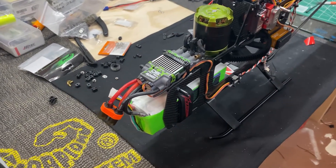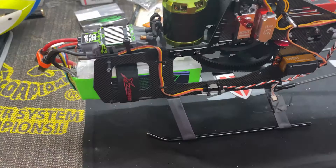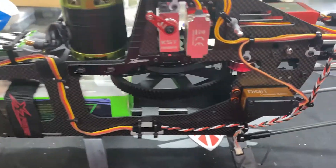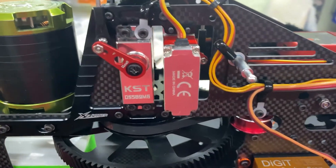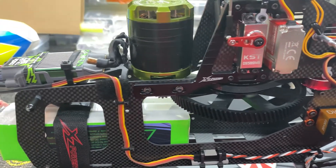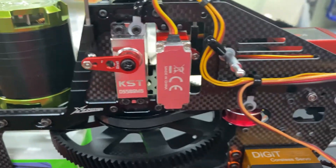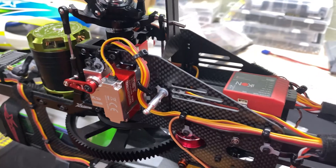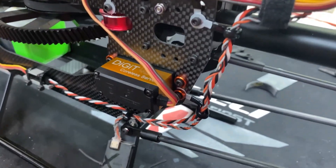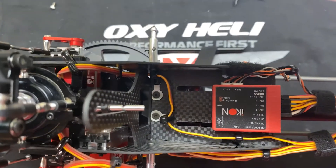Here's a quick look at the wiring - got the motor disconnected for setup. That's a six-cell Pulse 5000. All my servos - opted for some KSTs I had, and instead of using the included control horns, I bought these Seat Craft ones. All aluminum, the balls thread in nicely and leave just enough threads to be flush with the nut. The plastic arms included did not do that.